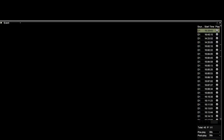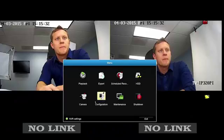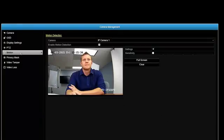D1 refers to video from the camera plugged into channel 1. D2 is channel 2, and so on. Click on the play button to review the specific video. Now, we also talked about the need to complete motion detection setup from that main menu. To do that, let's go to Camera and select Motion.